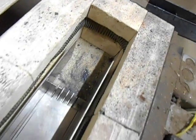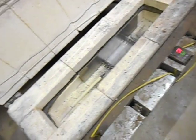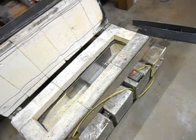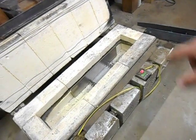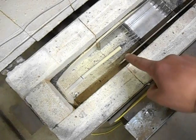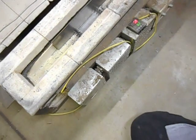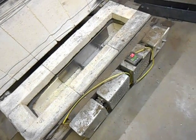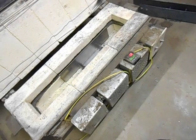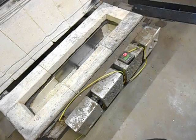It's made of 13 gauge Kanthal that I just wound on the lathe whenever I burn one up. It seems like I go through probably 3 or 4 of these heating elements a year. And it's got a thermocouple. That's the new one, not the one that was in there when I first built it. This thermocouple will go up to, I want to say, like 2100 or 2300 degrees Fahrenheit, which is enough for me to do stainless. The old one wasn't rated at a high enough temperature to be able to do stainless.